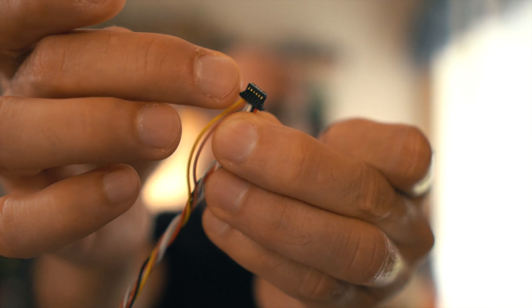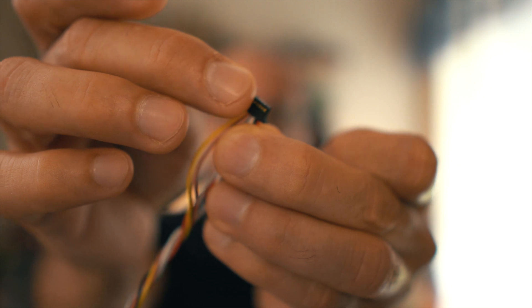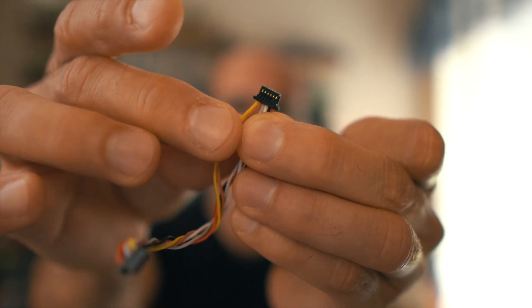These two cables are normally the last two on the harness. Rather than cutting them, I prefer to lift the plastic connector housing and remove the cables from both sides — that gives you a very clean cable to connect to your O3 and drone. This problem is a bit harder to spot because customers often buy a Crossfire drone, bind and fly it, then decide to switch to ExpressLRS. Interestingly, with Crossfire this interference doesn't happen — you can have the DJI SBUS and Crossfire soldered to the same port without issues.